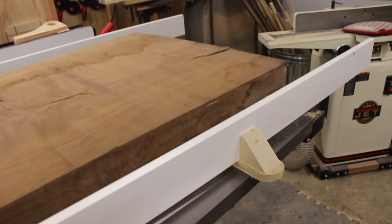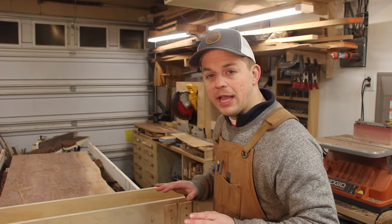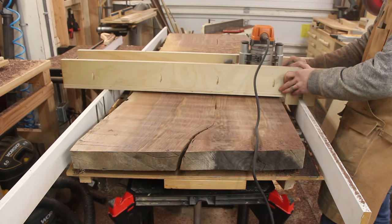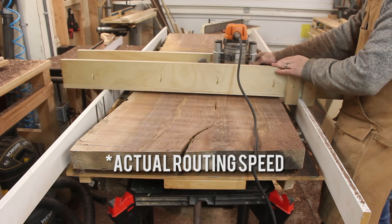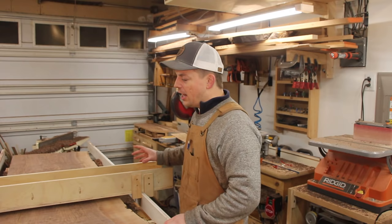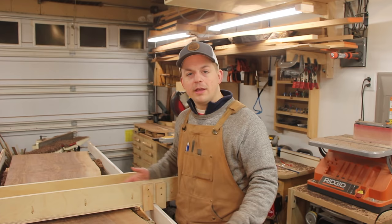For my setup I used some CA glue and glued some triangular blocks onto the back of this trim, then glued it down to a piece of plywood. That way when I'm done I can break it all down and make a new one next time I need to mill a slab. A lot of people also spend a lot of time making sure everything glides really smoothly and is waxed perfectly — honestly I don't really see a huge need for that. When you're routing this it's going pretty slow. This is not a CNC machine that needs to travel on an x and y axis seamlessly. I just go back and forth, slide it over to the next spot, and it doesn't really need to be smooth as butter.